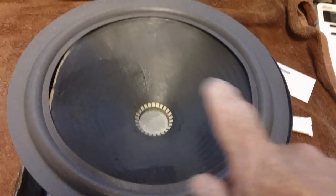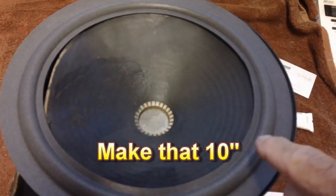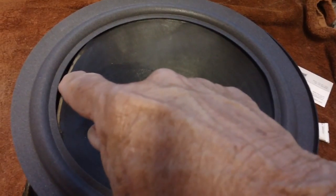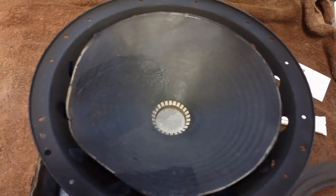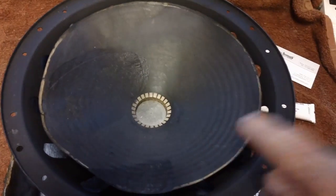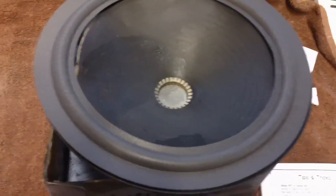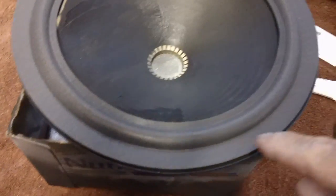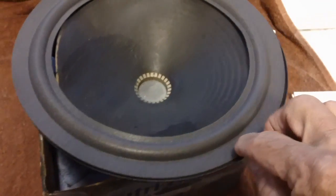Now in an earlier video involving this speaker, I told you that the surround is ten and a half inches in diameter on the outside and eight on the inside. The problem is our basket is nine and a half to the outside and seven and a half on the cone, which means something's got to be done with this foam. According to the instructions, you can take a pair of scissors and trim it very lightly around the edge to where it fits down in the basket real nice. I didn't particularly care for that idea.